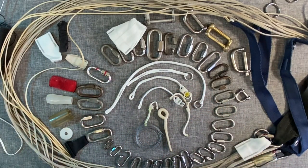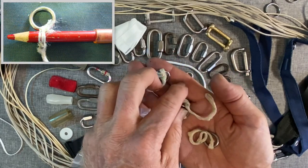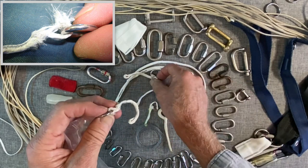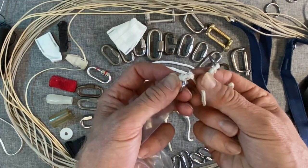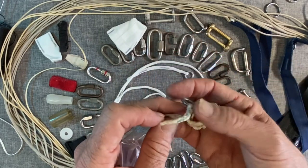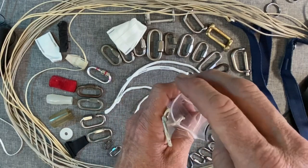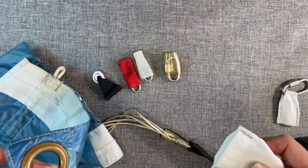Imagine what that's going to do to your soft link. In fact, I have one pretty nice example here — you'll see it in the enlarged photographs. This came in for a reline. Ordinarily I wouldn't change soft links if they didn't look too bad, but this was shocking for me to find a soft link in that condition. Thank goodness the lines needed replacing because the owner had never noticed that the damage was quite so extreme. It was on a canopy without cascades, so a huge amount of aramid line helped to increase the friction.